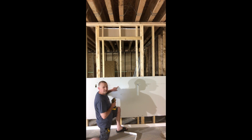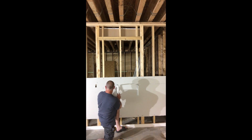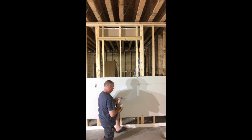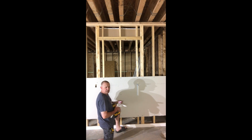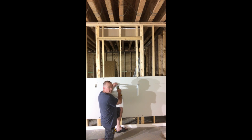hole. All you want to do is nice and slow, get that thing sucked flush, which means flat. Okay? Then you take your bracket, you put your bracket up. Actually, set your screw up first. I miss my camera girl. Both of them. Put your bracket up. Stick the screw in. Screw right into that anchor.